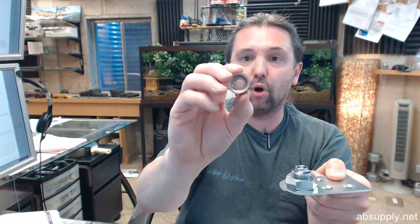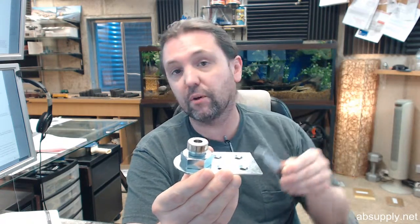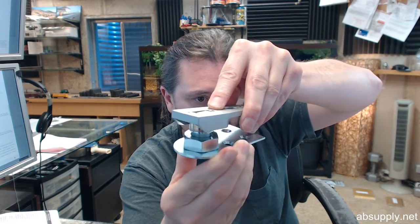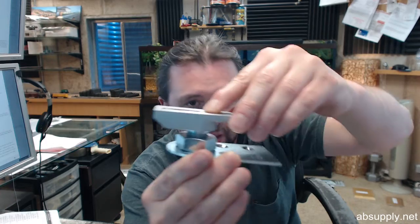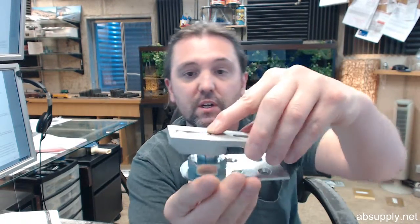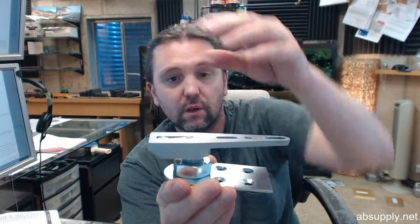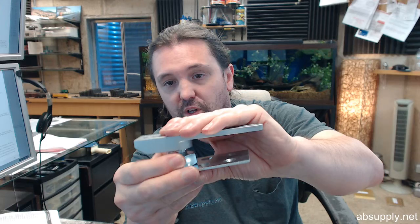Now, obviously it seems like it's loose, but the bottom line is when you bring that bronze bushing down on, like so, you then have your door portion, and it's an end load, and that means that you will install this from the end of the door, through the stile, and your installation is literally like that. There's a little spring clip in there, and under weight of the door, it will just snap over and stay securely in place. And then, of course, the weight of the door is what provides that proper movement and maintenance of the adjustment that you've created. Okay, that's what your installation looks like.